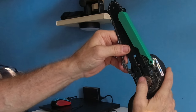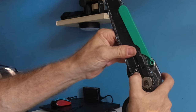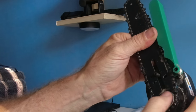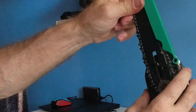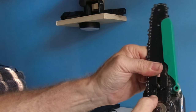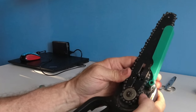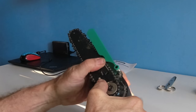Lift up, make sure everything falls into place. It takes about a minute to change the blade. You're going to put it back into this pinhole right here — it takes a couple of seconds. Take your time, don't rush. If something is not sitting correctly — that's why I'm having just a little difficulty — rotate things around, and there we go. I snap it into the guide line.